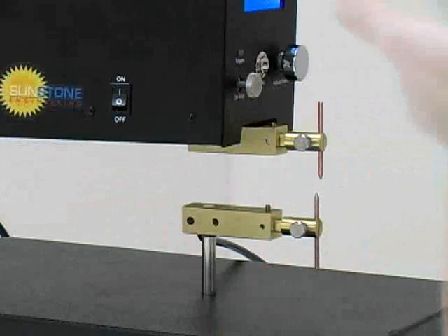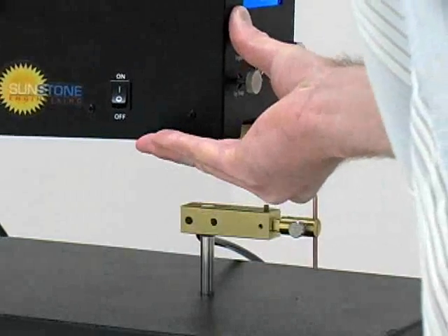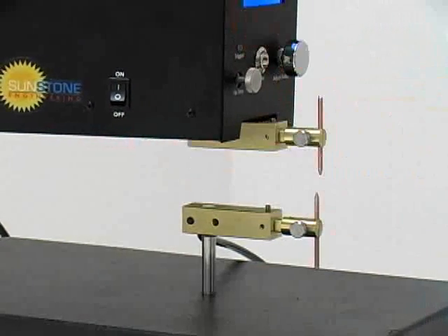Use a setup spacer that will allow a space for the workpiece to be welded plus a 3/8 inch gap. The 3/8 inch gap above the weld surface will ensure true vertical alignment. This is recommended, but not necessary.